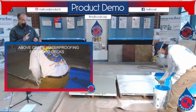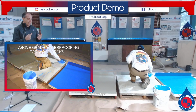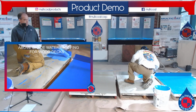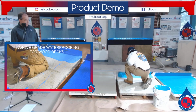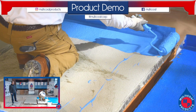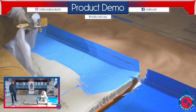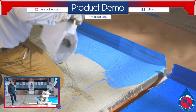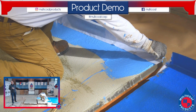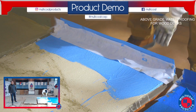We ask you to do this also around any penetrations. I have a lot of guys that do it around the perimeter of the decks, if you have a post, any penetrations, drain system. So as you see, he's just taking a 3/4 nap roller here. He's just applying a coat of Multicoat both on the flashing and on the deck. And what he's going to do is take our polyester stitch bond fabric and embed it up the flashings. What this helps do is strengthen that point there against the flashing.